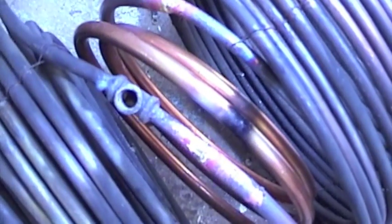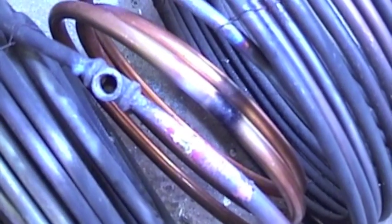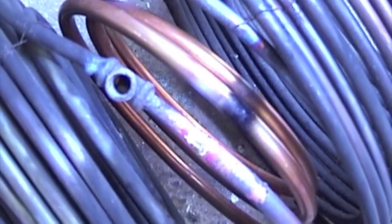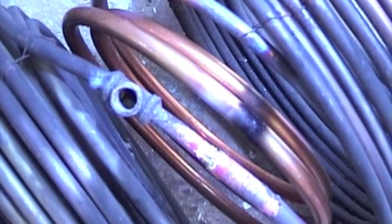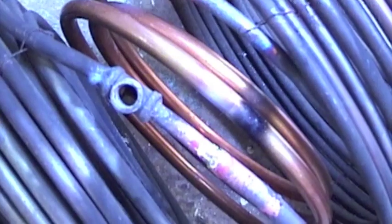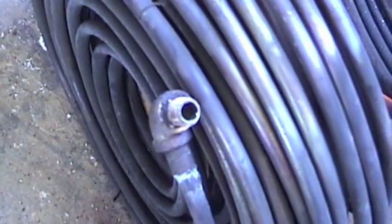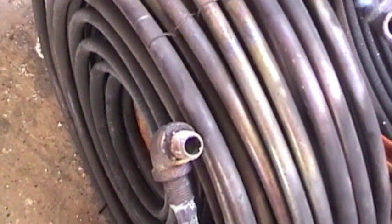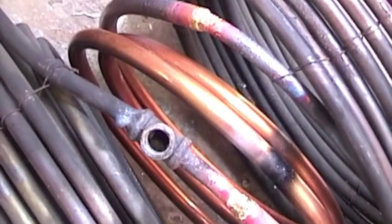The welds are done and you can see that coil is still kind of close to being a water wall, but it's more centered, so it's going to pick up some of the radiant and convective heat. I know it's going to prime a little bit, but I think in these 150 feet of spiral wound coils it's going to turn to steam. So we'll see — that's the idea.